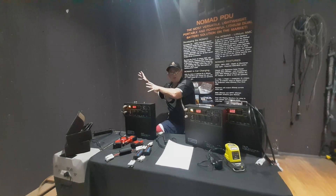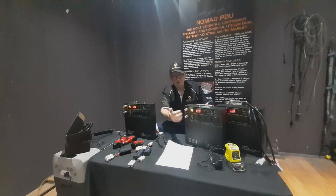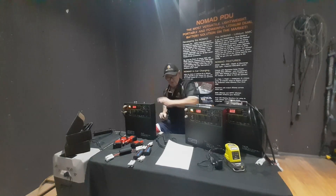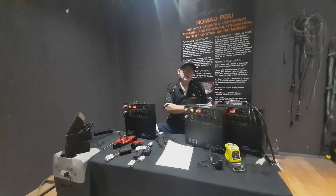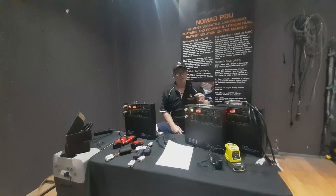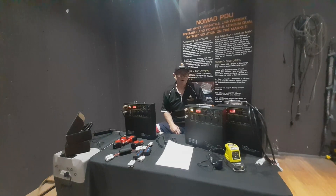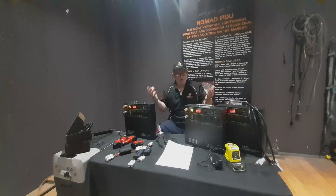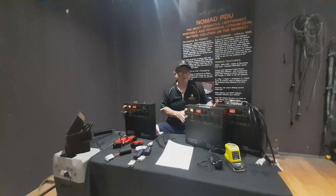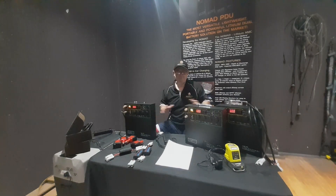So: if you've got a regulated solar panel with its own regulator, the power comes across and goes into the regulated input. If you have an unregulated solar panel of 200 watts or less, connect it straight into the red and black poles — it'll go to the MPPT internally, which will regulate the charge for lithium. We get a lot of people asking: can I charge at the Anderson and also unregulated at the same time? The instructions say don't do it, but theoretically you can — however you must understand that the unit cannot be charged at any higher rate than 25 amps at any given time.